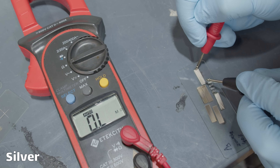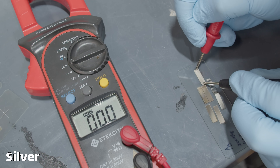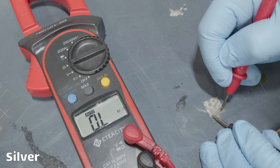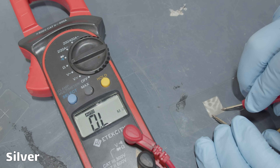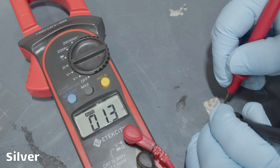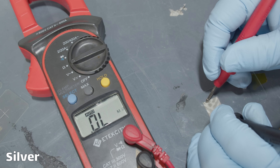It's not great for patterns but better for large blocks of deposition. In theory you should be able to deposit a large block of metal, flip the glass slide over, and etch it back off with the same laser. Of all the tests I ran, silver definitely had the best conductivity and a pretty wide process latitude. Depositing large blocks using the standoff technique was a little more variable — some sections are grayish, oxidized silver with poor conductivity, while others retain their silveriness and are pretty conductive.